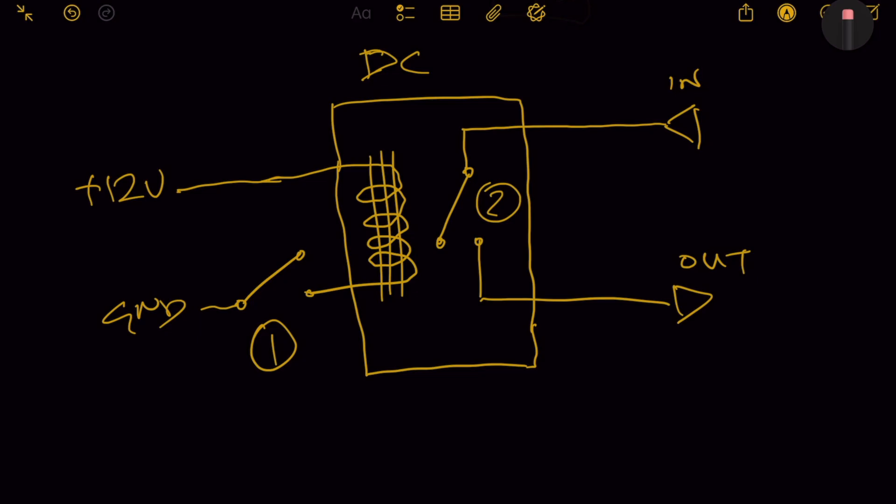You could also implement the switch as a panel switch on the front of the amplifier — a toggle switch switching the channel back and forward, or the gain stage, or a feature on the amp. It's doing the same thing: activating the coil on the relay, which then allows switch number two to open and close.